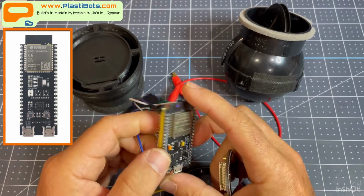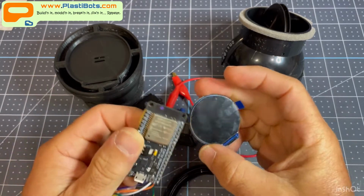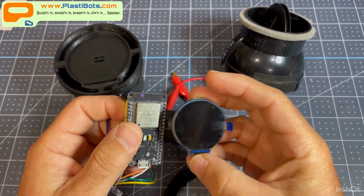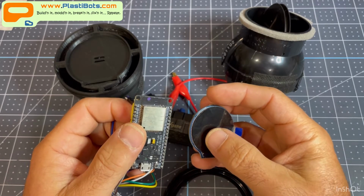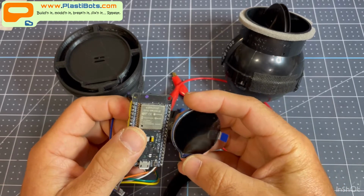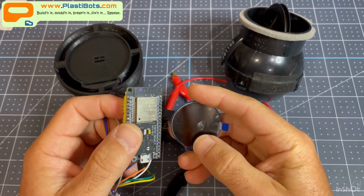an ESP32-S3 that I bought. It's a little bit longer than this. It's about that long. It will allow me to get the necessary display connectivity for the 2.1 inch. I think it's 27 wires. So it's an SPI and RGB interface, so it's quite a few wires that it needs to talk to the display. Unfortunately, it's not just SPI, and sadly, I don't need a lot of speed. I'm not going to be doing video on this thing.